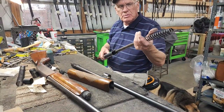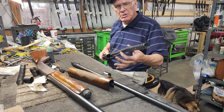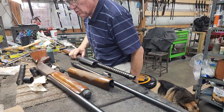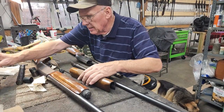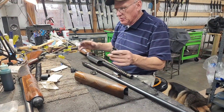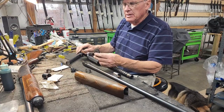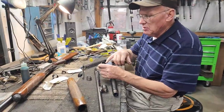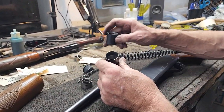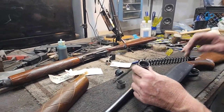This spring goes on first. When you're sliding a spring on, you want the free end - if you feel some resistance as you put it on, there might be a burr on the spring or something - make sure that goes to the bottom so the top end is free. Now there are two or three different kinds of recoil springs - they made some changes over the years. Most of these old guns have one of these collars in it that says 'up towards muzzle.' These have a cutout inside where they have felt or something that holds oil. I've made up some new rings with the same cutout where we put a piece of chamois cloth that holds oil and stays in place better.